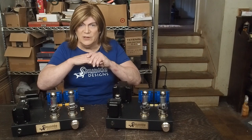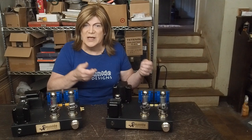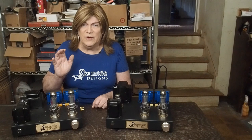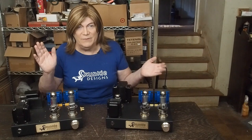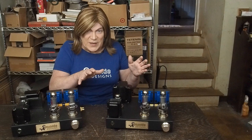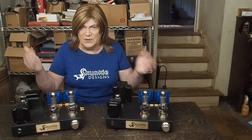And the price we're paying for saving the money off the second choke and putting in the second filter capacitor is, if you want to put your ear up against the speaker and have it be silent, don't skip the second choke. Obviously, I don't think any of us are going to be listening to music with our ear up against the speaker. And like I said, literally moving it that far away, I can't hear anything with my house totally silent. So for all practical purposes, this is perfectly fine just as it's built. If you want that next step of perfection, go ahead and add the extra choke and the extra filter capacity to ensure that you have absolutely no hum getting into the B plus that's going to the amplifier.